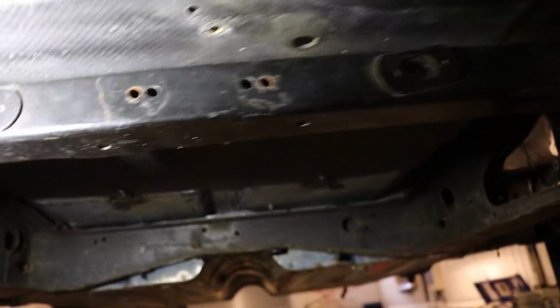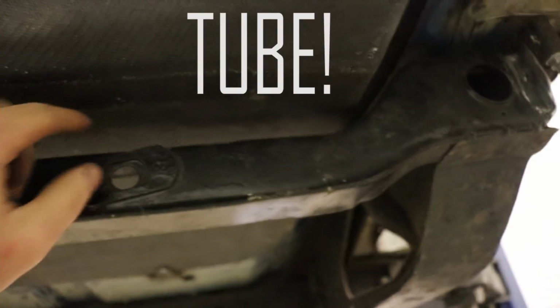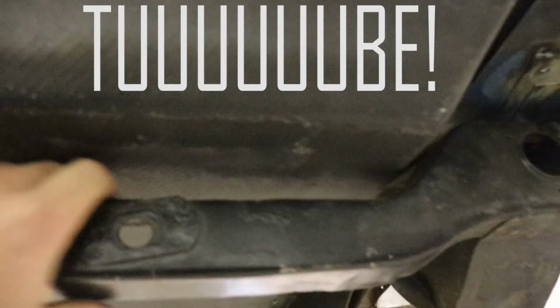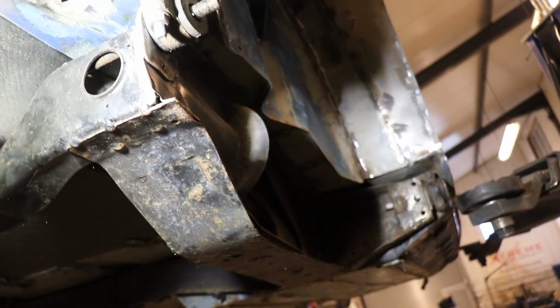This piece gets removed, this piece of the rear subframe, and just gets replaced with a bar, and I'll mount that bar tight to the bottom of the boot floor, and then I'll probably make some tabs that come off of the bar so that we can bolt the tank through the carbon boot floor and then into that bar, I think, just to make sure everything's bolted together really solid. And you can see where all the valance has been removed. Save a bit of weight there, and also this gets modified so you can adjust your ride height through the back here, so it gives you good access to get in and adjust the corner weight and ride height.